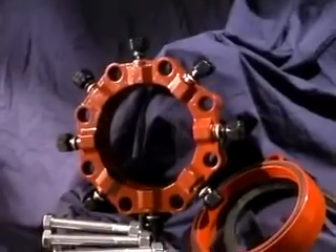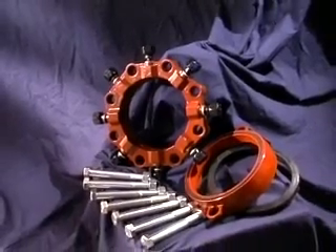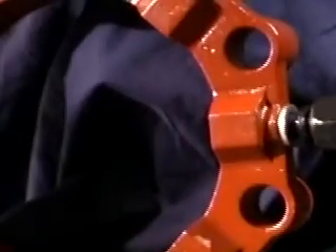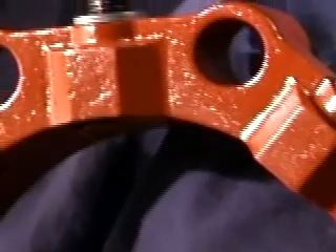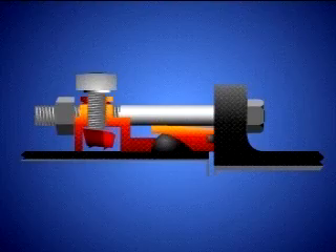The Series 2100 Mega Flange Restrained Flange Adapter is a versatile and convenient replacement for threaded flange spool pieces. A restraint ring features wedges around the circumference to grip the pipe firmly so the Mega Flange can endure severe movement loads. A gasket ring separates the seals, sealing each surface and enabling the joint to deflect during assembly.